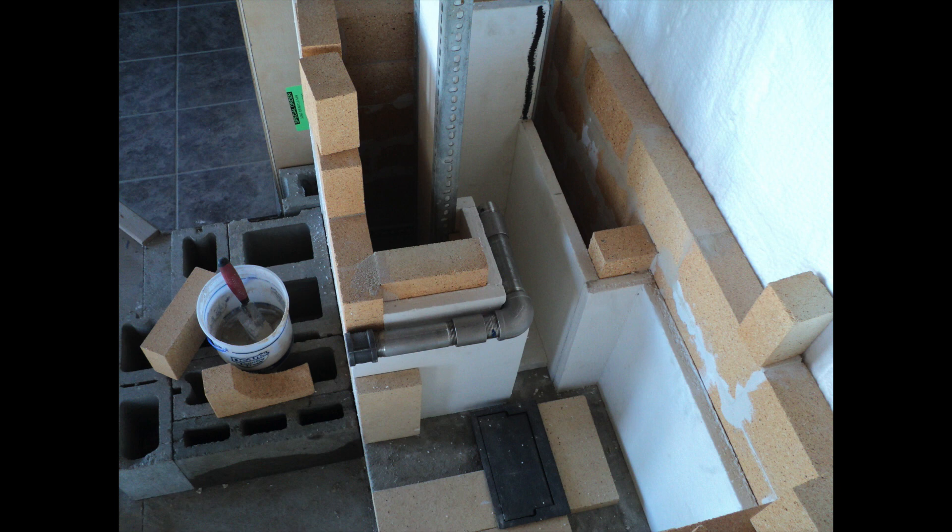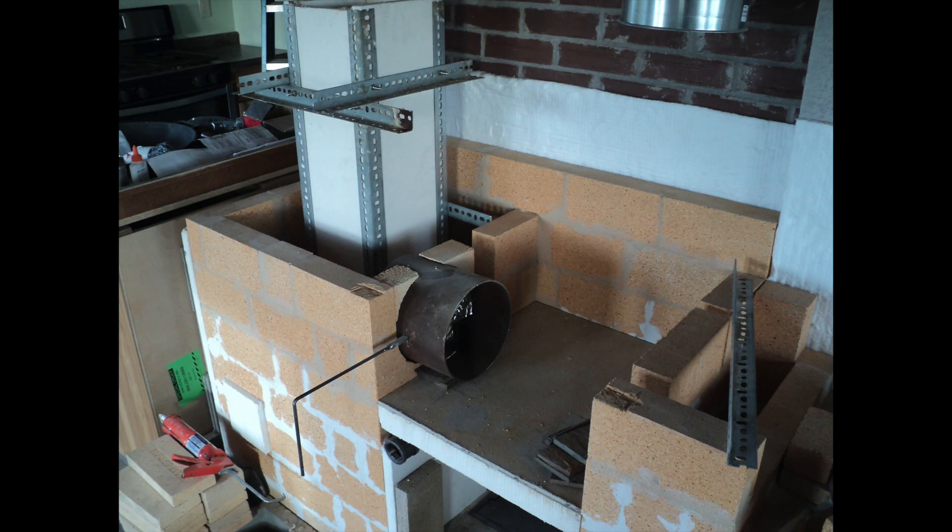The firebox was first lined with one inch thick ceramic fiber board. Then loose replaceable fire brick were placed around the walls and the floor of the firebox in case they were broken later from use. The passage to the riser tube and the riser tube itself is made with one inch ceramic fiber board. The piping that you see in this picture was to be a secondary air burn for the riser area. I found out later after using the fireplace that this pipe wasn't really necessary. The roof of the firebox I insulated with two inch ceramic fiber board — and that is the trick of a hot clean burn: a well insulated firebox with plenty of air.